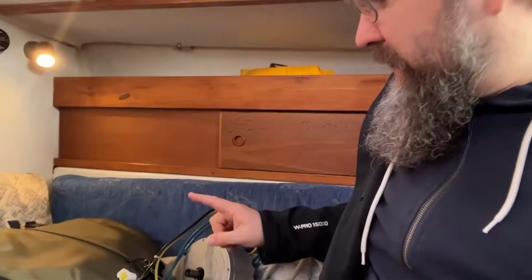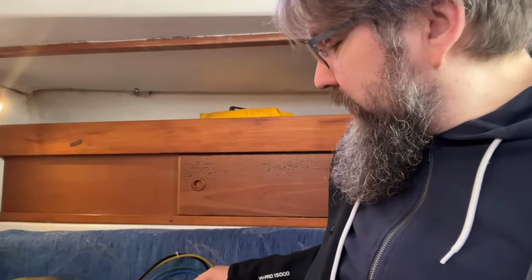So what happened last summer in late July, I believe, was that some kind of thunderstorm or something like that, a surge from the grid, came and broke my chargers in this boat. I had 2 chargers, one for the 48 volt system and one for the 12 volt system just for the fridge. It has a separate battery over there. But both of those chargers broke. Nothing else seemed to be broken except for the sensors inside the motor. So I was planning a trip to Lake Päijänne for a few days, and I came to the boat and suddenly nothing worked. So I measured the sensors, and 2 of the 3 sensors inside this motor were broken.